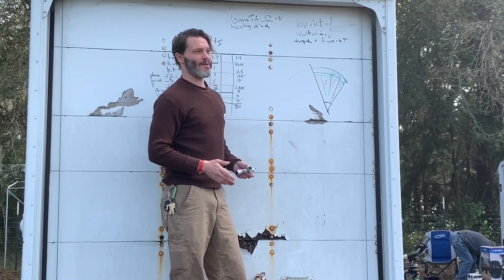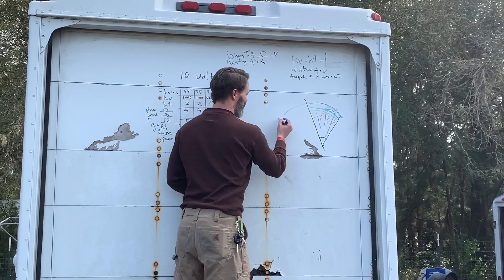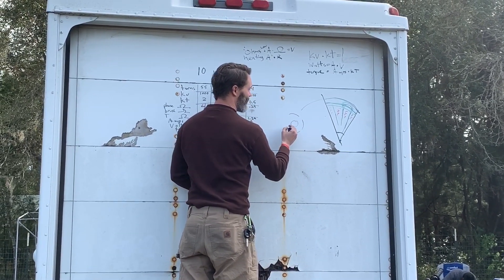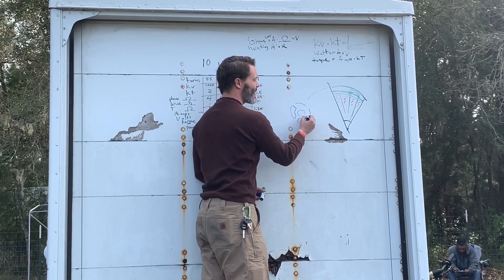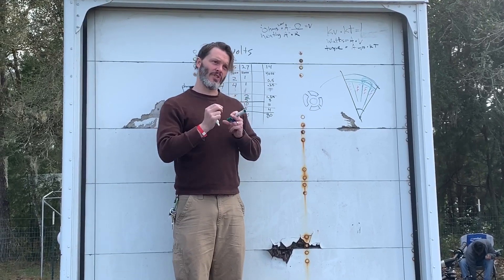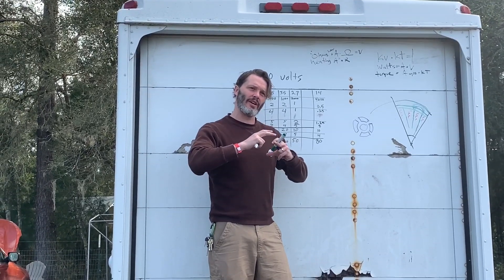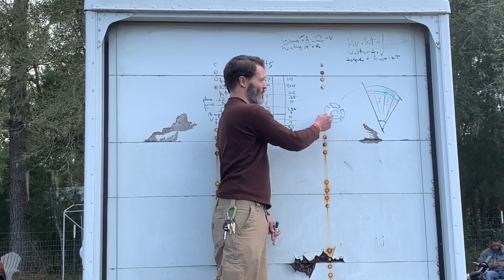You can't quite double everything. When we make a rotor we have to have a shaft supporting everything, and when we put our magnets in there's going to be a little bit of separation. The first reason for this gap is manufacturing variation - if magnets are all butted up against each other, a little variation means you'll always get a gap somewhere. If they're a little oversized they won't fit; a little undersized you get a gap. Your rotor gets wonky, the flux coming out gets wonky, startup gets wonky - it's just poor engineering.